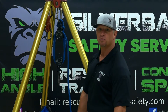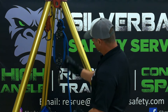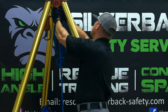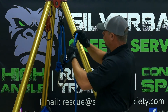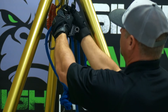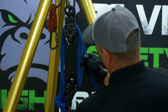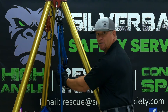Alright, so after we build our 4-to-1 block and tackle, I just want to show you how simple it is to flip that 4-to-1 over and turn it into a 5-to-1 block and tackle. For the 4-to-1, we'll disconnect the top pulley, and as we flip it over, we'll reconnect this pulley at the top. And we'll have to add one more pulley — it gives it no mechanical advantage, it's just a change of direction — that way we can pull it in a downward position. In this 5-to-1, you'll have two pulleys moving and one knot going down to your load.